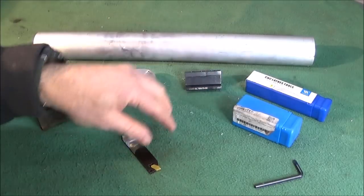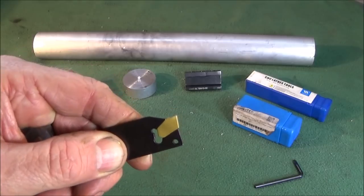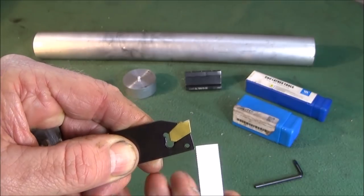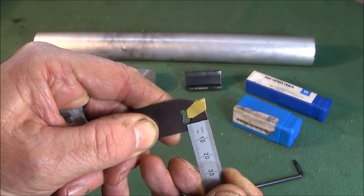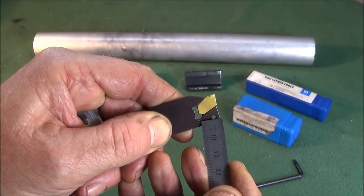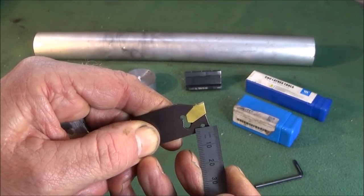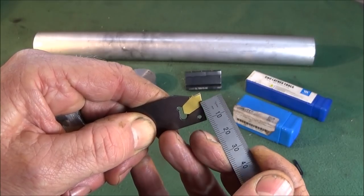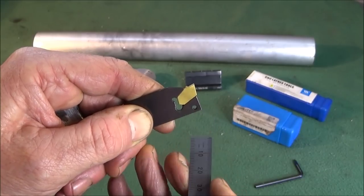So on this 19mm blade, I'll just show you a close-up before I show you the modification. You can see this section here, this cutout, and on the lower side the thickness there is only about 3.5 to 4mm wide, and therefore that's not strong enough to actually stop this section here from bending. As soon as there's pressure applied to this insert, it pushes it into the actual cutout, and this lower half, like I say, bends down.